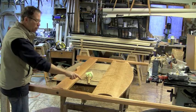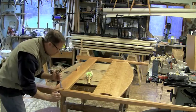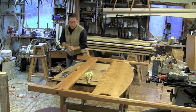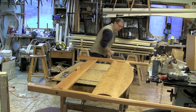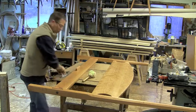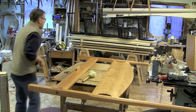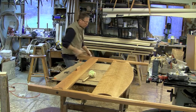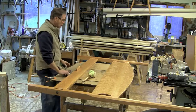You don't want to crank the headboard joint completely until you know it's tight. Hit that in and tighten, and check this end also to make sure that's in. A little tapping is nice here. Make sure that's in tight. The headboard joint is a floating joint, so it allows the board to expand and contract seasonally. You could bolt it, but traditionally it's not — it's just hung there between the posts.